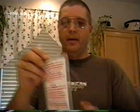What you do next is very important, because you'll notice on most of the bags that the membranes come in, it says right on it: 'contains preservative solution — this membrane element must be rinsed under pressure before being soaked or stored in water.' A lot of people are confused about what that means, but it's really simple. Once you reinstall the membrane and turn the water supply back on, all you need to do is open your faucet and let the water run for about two hours. This flushes the preservative off the membrane. It's a food-grade preservative, so it's not going to hurt you — it just doesn't taste very good. Open the faucet, let the system flush itself for two hours, then close the faucet, let the tank fill up, and you're ready to go.